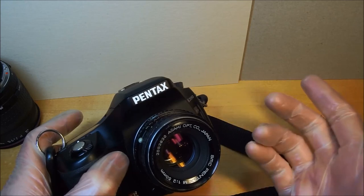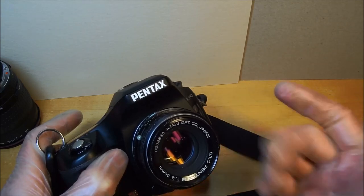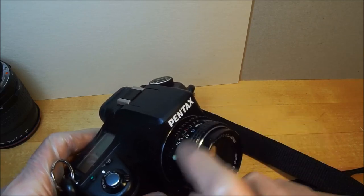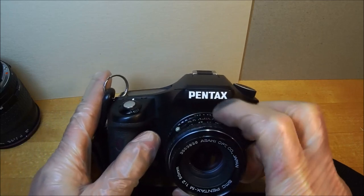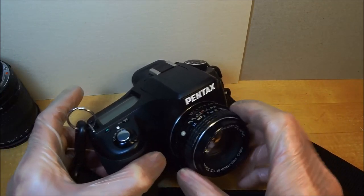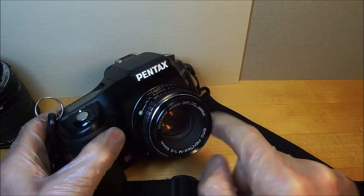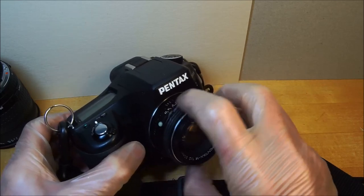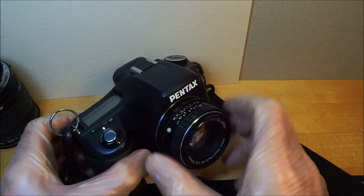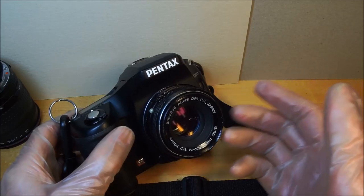This is another key lens. Pentax makes a great M 28mm f/2.8 and I highly recommend both. I did a previous video on this lens — it got dropped, you can see it got hit, and the focusing ring became slightly egg-shaped and was rubbing on the lens barrel. I took a rubber mallet and a block of wood, removed the lens, and tapped the focusing ring on the opposite side to un-egg-shape it. It works really well now and it's easy to focus.